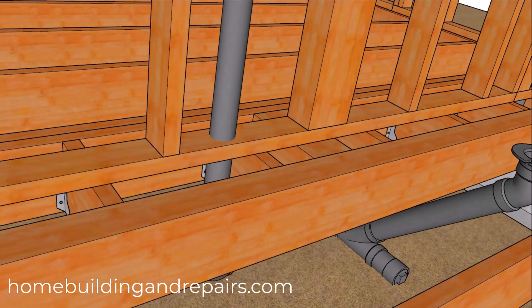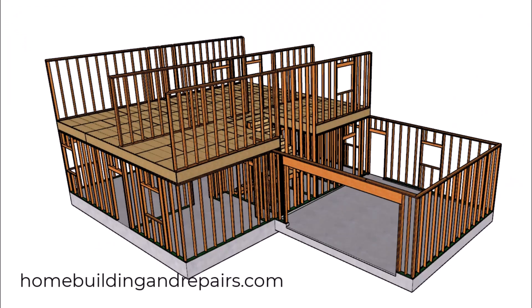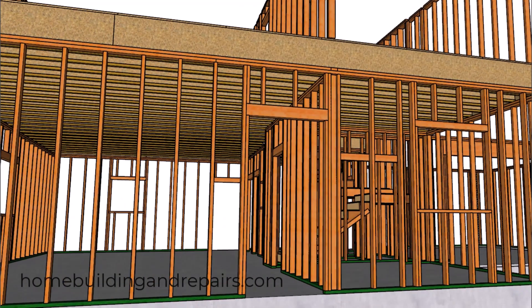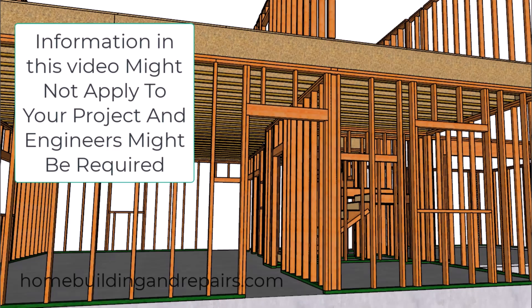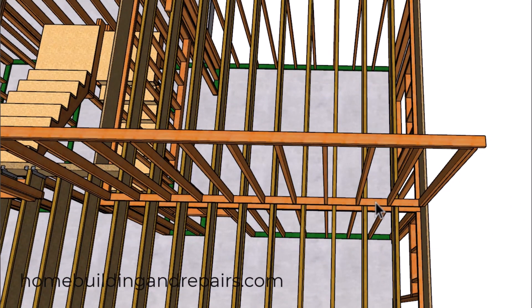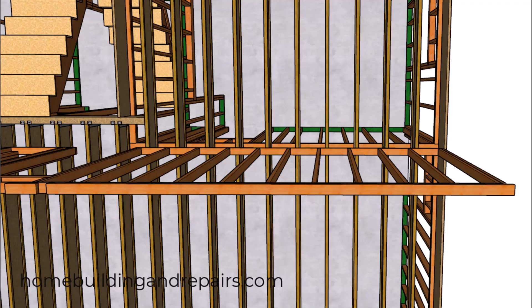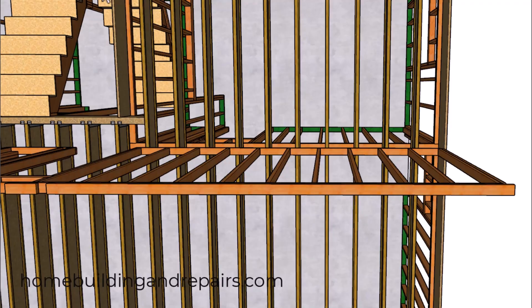Next up, let's take a look at some more information about blocking that might be found in a lumber manufacturer's assembly catalog. In this video, I'm going to be talking about the truss joist from Weyerhaeuser and how you might use squash blocks or regular blocks to transfer the load from a wall above — a wall that's sitting directly above the lower wall — along with what the manufacturer suggests you could use. Keep in mind that a structural engineer could provide you with different details altogether.